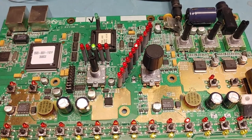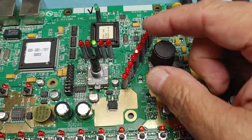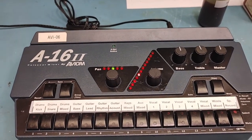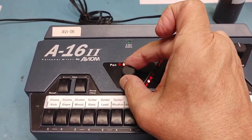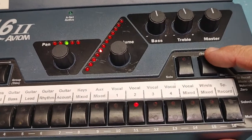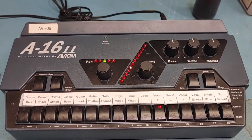All right, it's all done. I've got the new rotary controller in there. Give it a quick test — up and down, no jumping around, everything looks good. Let's button this thing up and give it one last test. All buttoned up now, everything looks great. Volume control is working like it should. Balance control looks good. Each one of these push-button switches — they're all working. This is the one that I repaired. We'll whack it — there we go, we can see the trim coming on, so we know that button works as well. This thing's all set and ready to go.